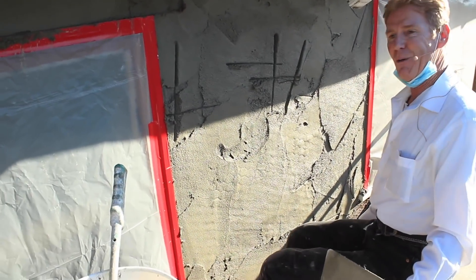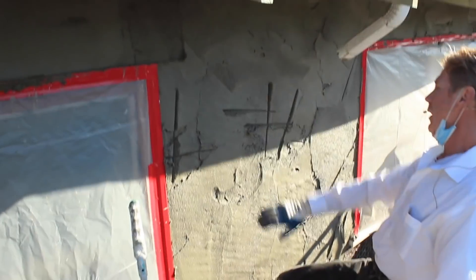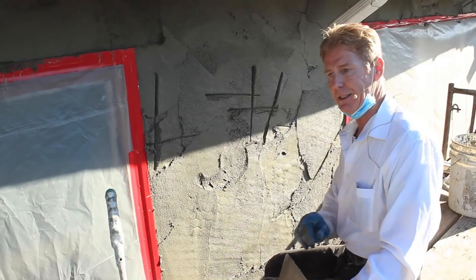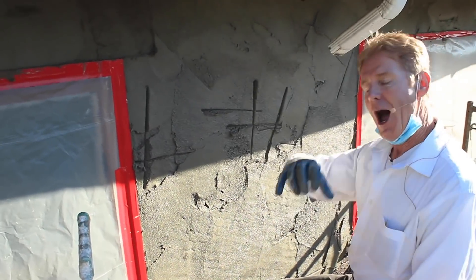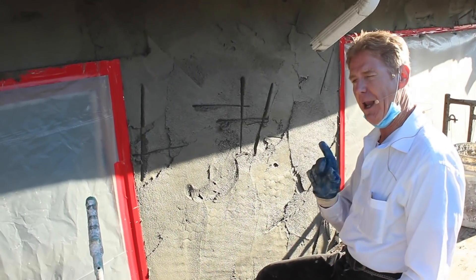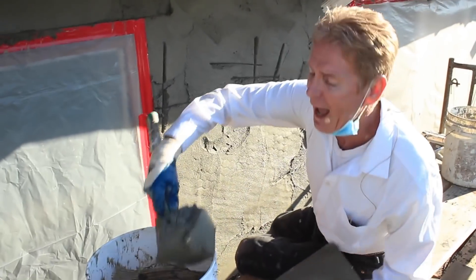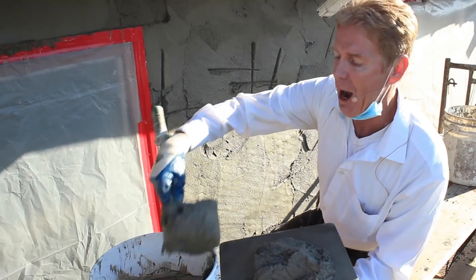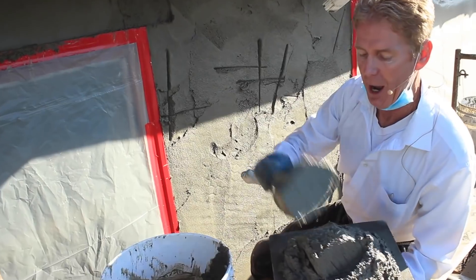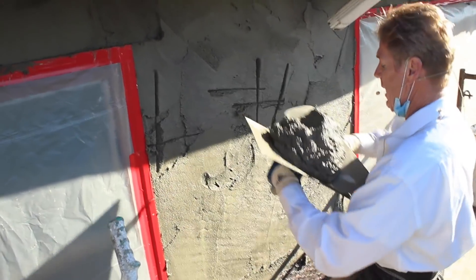Every job's got windows, guys, unless we're fortunate enough to do big walls. What I've done here is put a scratch coat on. Since we're doing a same-day system, I put a scratch coat on, let the paper suck that moisture right out of the stucco, and I got the feel for when to put that next coat on. I just applied this, so what I'm going to do now is put a second coat on — because I can. That's the same-day stucco.